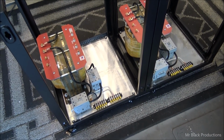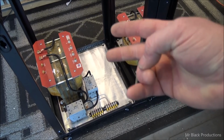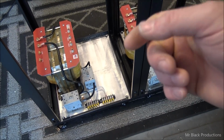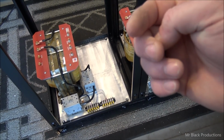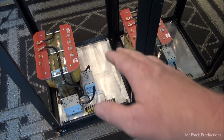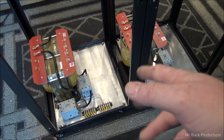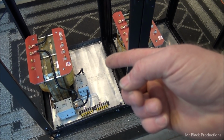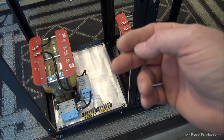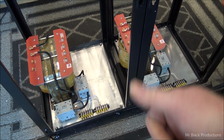But yeah, I want to get the soft start circuit in, and I want to get the filament in, and I want to get the high voltage capacitor in today. And the filament has got to go on its own separate contactor, and then the low voltage DC side for like the relay, cabinet power, that kind of thing. What I mean by cabinet power is, you'll see, it's going to be really cool. So finish the soft start, then filament contactor, and then the low voltage, and then fan contactor is where I'm going to get to today. That's my goal. And high voltage capacitor.